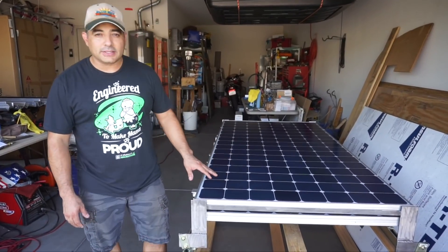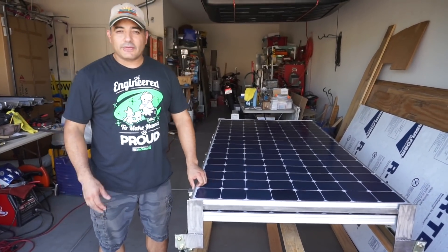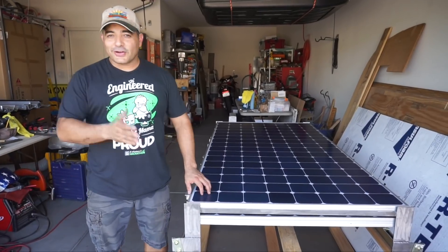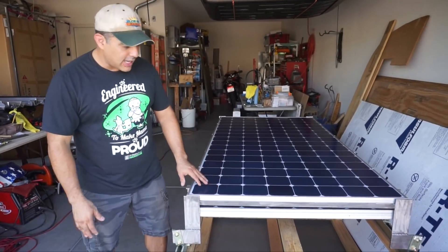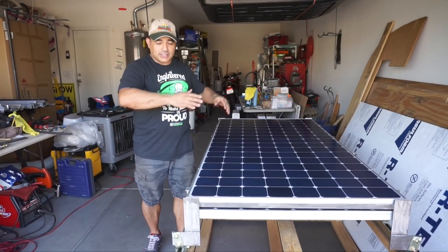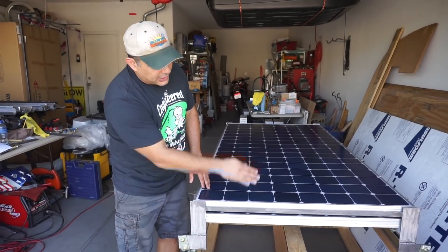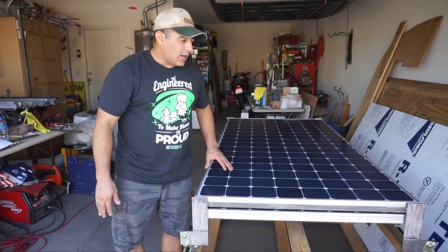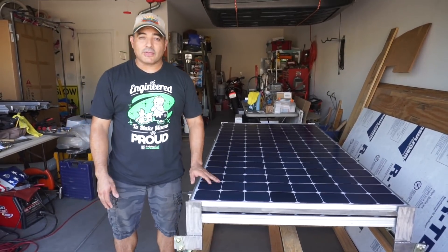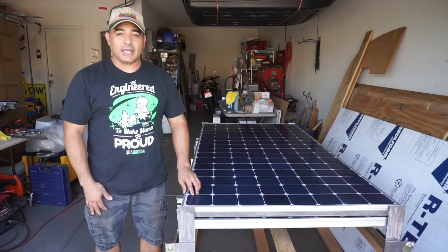Another big concern with panels on the roof is a gust of wind coming up underneath and trying to lift them off. We've seen a few other videos where that happened and it broke and destroyed several panels. So we want to learn from that experience and mitigate it. We'd like to build some shrouds on either end of the enclosure, as well as on the front, to break the wind and get it to go up over so that a big gust doesn't cause that issue. We're also going to secure them with a lot of hardware and clamps.